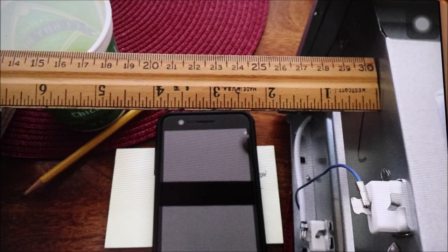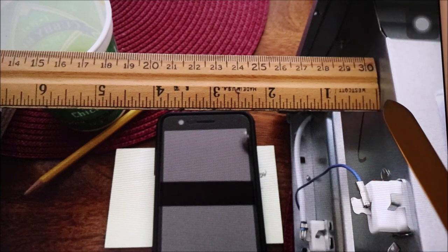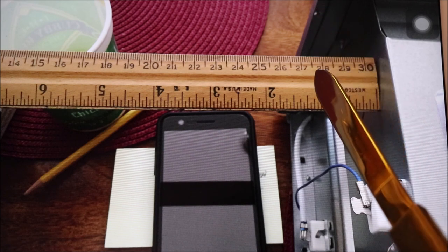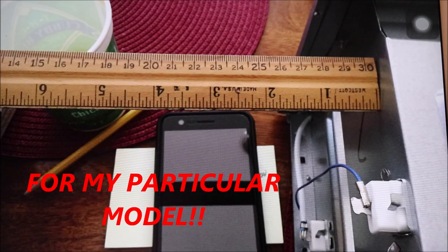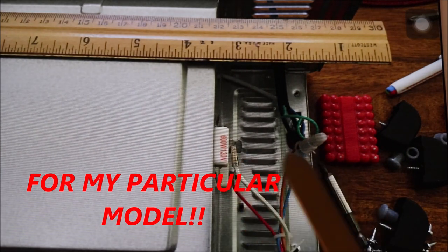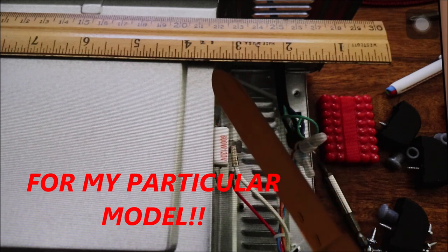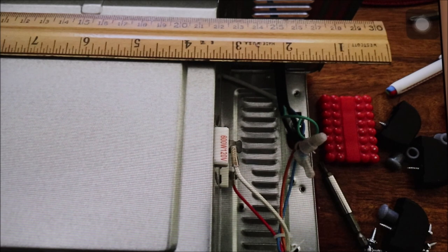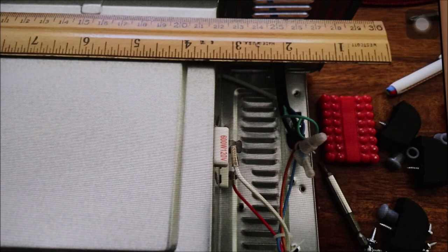Here's a picture of the toaster oven with the one-piece cover removed — it only took a couple of screws. This is the inside of the toaster oven: this is the side wall and this is the edge. What I'm demonstrating is that there's at least approximately one inch of clearance — a little more than that — from this surface to the interior surface, especially up at the corners. Similarly, on the other side there's something more like three inches of clearance, and nothing is located up in either corner. So from an electrical clearance standpoint, if your mounting screws don't protrude too far into the enclosure, you're going to be totally safe.